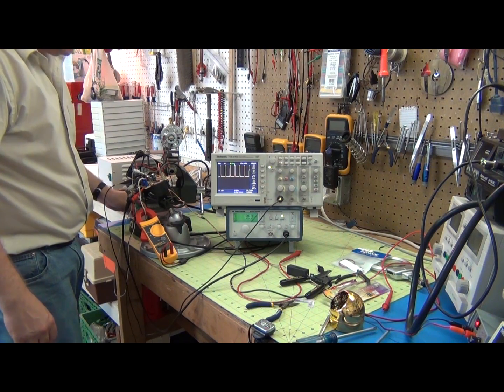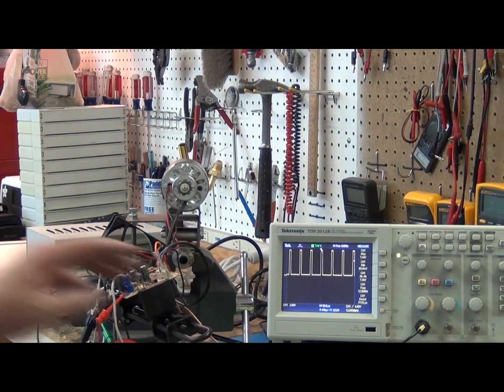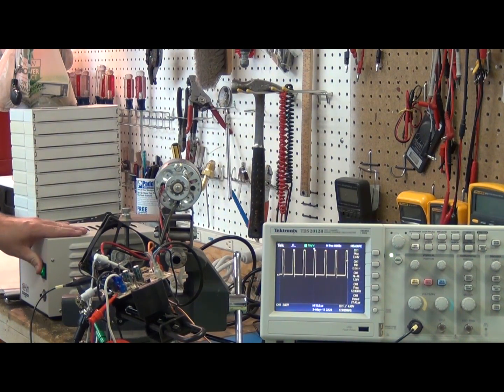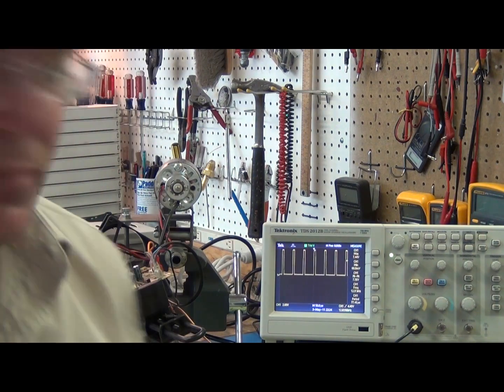There we go — got the fan blowing on it now. The motor is here — look at her go! Wow, that works great! That was the whole thing: that pulse width modulation chip has an internal transistor that's still strapped to ground. It's not engaging — that's why it's not working. Because of the logic inside the pulse width modulation chip, it keeps that transistor at ground, essentially pulling that pin to ground. So my function generator couldn't really help the situation before — it got drawn to ground too. But now it comes on and stays on.